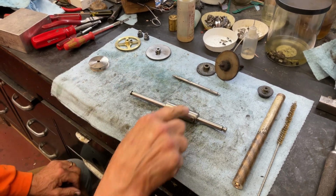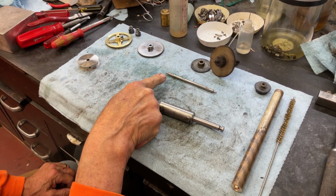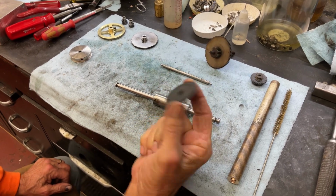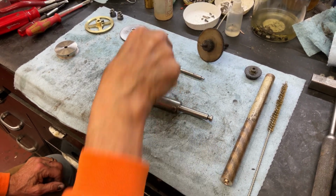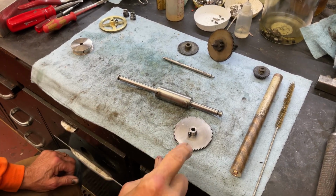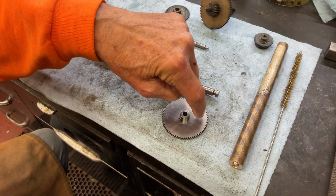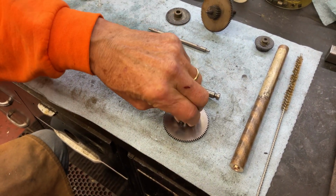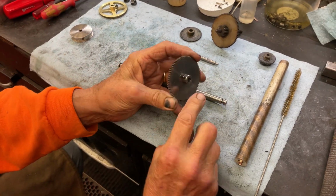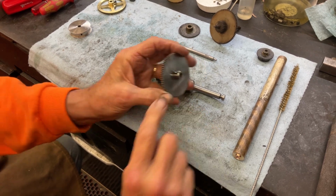The other thing is you want to polish out all these shafts to the gear train. You don't want to clean this off a little and end up with this icky gooey mess. You want a gear, when you assemble, to look like that. And on A1s, these are all nickel plated. You can see my fingernail in this. These are all nickel plated on the outside. So you want to clean these all up very nicely. And then I spend a lot of time re-bluing all the screws so that it looks nice like that.